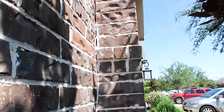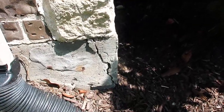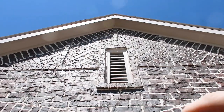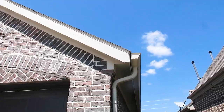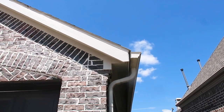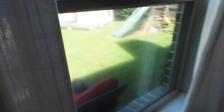Some minor things we found: a cracked and damaged window; mortar needing improvement on the front side of the property where the wall settled and popped out some mortar; corner pops, which are cosmetic in nature; a missing gable screen in the attic — an easy entry point for rodents or bats; and a gutter that popped off, which we caught on the wide pass around the property after missing it on the close pass. One more thing: this window is slightly fogged — the thermal pane has lost its seal. Due to the age of the property it probably falls under warranty, so the sellers might be able to take care of it for free.